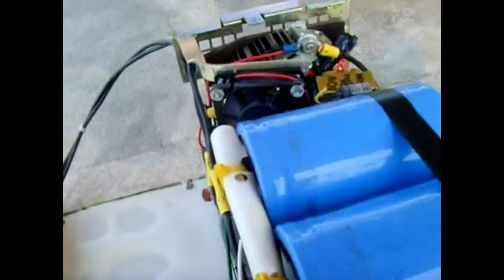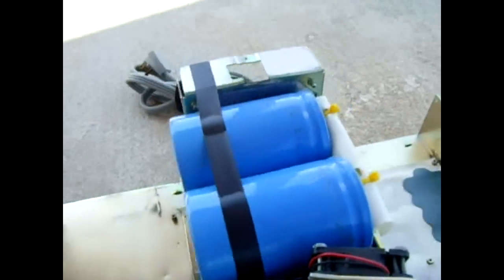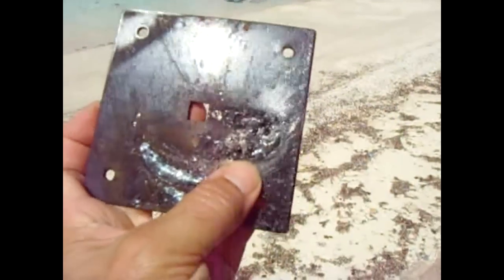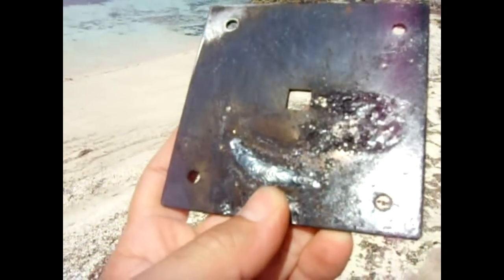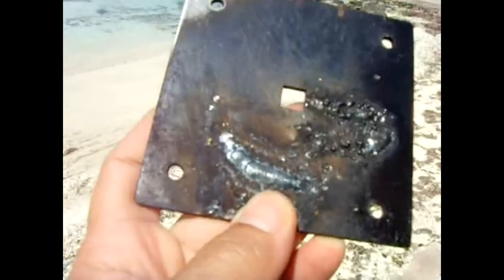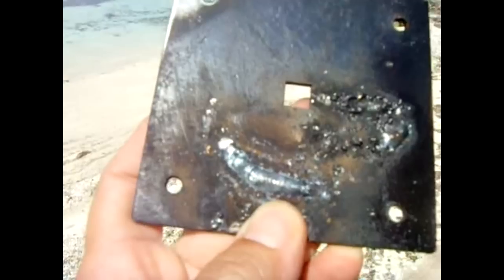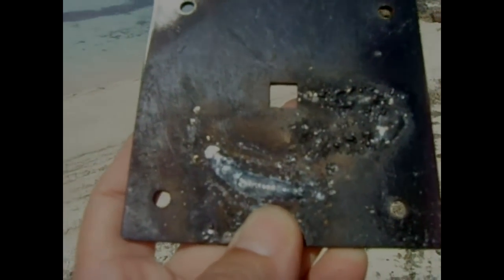It's connected up and it works fantastic — very smooth welds. Let me show you a sample on the plate in the sunlight. This was just from banging the stick on it my first time using it to get a feel, and right there above my thumb you can see a nice weld — it just flows perfectly. That's on 1/8 inch steel. It'll probably do 3/16, possibly a quarter inch if you keep concentrating the heat with the stick in one spot, but 3/16 is good enough for me.